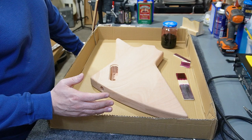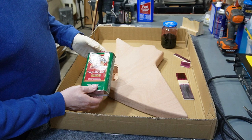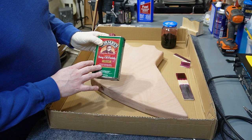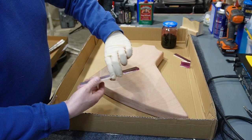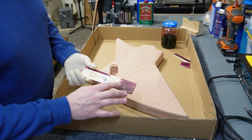Another thing I've been testing is tung oil finish over dye, and that actually works a lot better than I thought it was going to. I thought this stuff was going to take the dye off but it does not. This is an old bottle of Formby's tung oil - it's listed as high gloss but in reality it does not turn out to be that high gloss. It comes out really nice, kind of an even semi-gloss look. I've got two coats on this and I have not sanded it back at all.